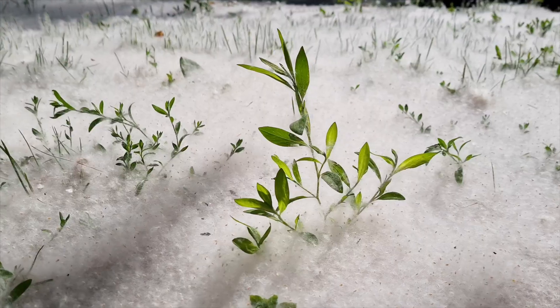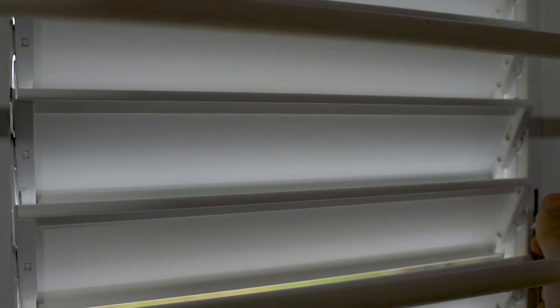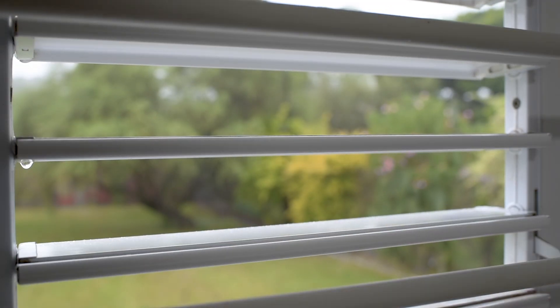One issue that arose was with my health. I couldn't stop sneezing all day and my sinuses and skin were constantly itchy. This was after allergy season had been over for a while, so it wasn't the pollen. I was physically uncomfortable basically the entire day. Eventually, I discovered that mold had grown around my sink, on my dish rack, in my bathroom, and more places. All the moisture my HRV was bringing into the house had created the perfect conditions for mold to proliferate like crazy. And that is the story of how I learned firsthand that ventilating can lead to unhealthy conditions in your home if not done properly.